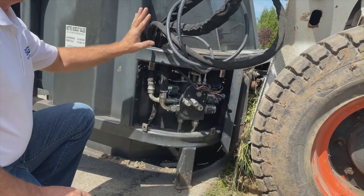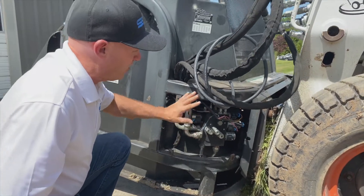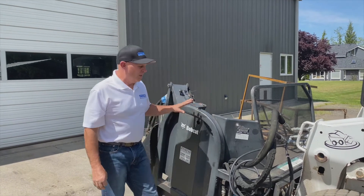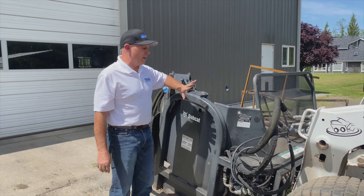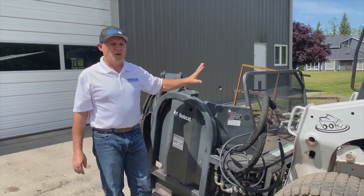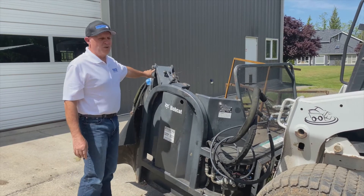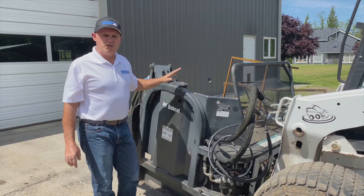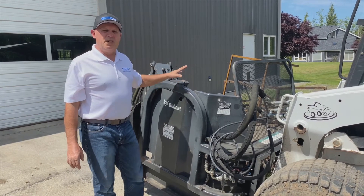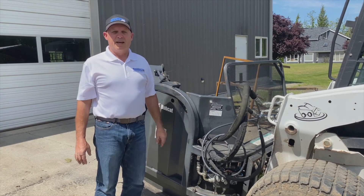In this situation, it's a very inexpensive harness to operate this. If you follow this video, you're up and going in about ten minutes. This is just how simple it is to get any Bobcat attachment going on any type of machine — it doesn't matter what the brand is. This is a 14-pin harness and it will work on any machine out there as long as you have enough controls. You do need six controls to operate this properly, however you can bypass the extend, leave it extended all the time, and just operate it with four controls. Contact us through our website or look at our FAQ section. If you appreciate this video, please buy your products from us and don't support the guys that are knocking off our stuff. We appreciate your business — come back and see us often. Thank you.